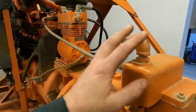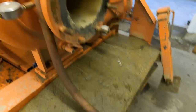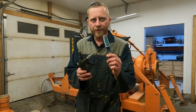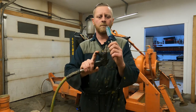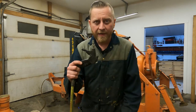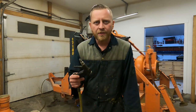While mostly air but some water is drawn up the intake side and discharged into the environment. Now you may ask what a Venturi is — I have a perfect example, let me show you. By using high compressed air from my shop with a blow gun and a screwdriver, this will show you the perfect effect of a Venturi. This screwdriver will actually end up floating. Now that's what we call a Venturi effect. As the compressed air flows over the screwdriver, it causes a small amount of friction and uplift that will actually make the screwdriver float. It's the same concept that dredges use for underwater mining.